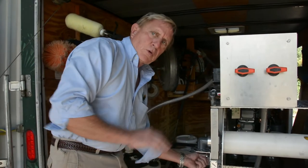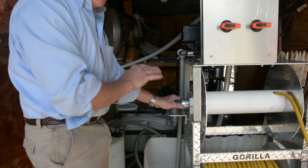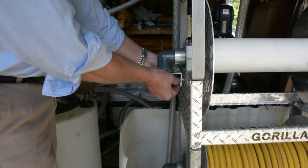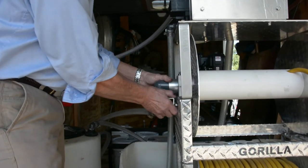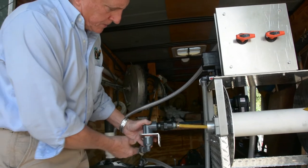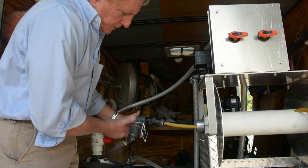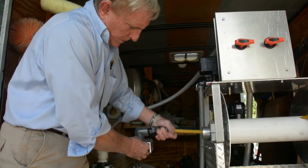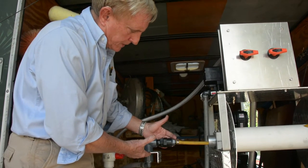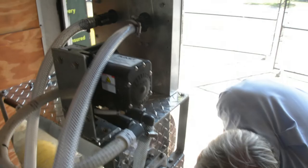Here's what makes the Guerrilla Reel work so well and so simply. All the components that could be damaged by bleach are the plastic components in this assembly. By removing these two bolts you can pull the assembly right off. We've double-nutted these studs so you unbolt it, slide it out — you've got the swivel in here — and if something is broken or leaking, it's all still hooked up. You can pressurize the system, see where it's leaking, unpressurize it, replace what you need to, pressurize it again and inspect it before you reassemble it.